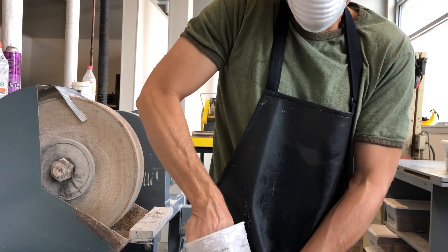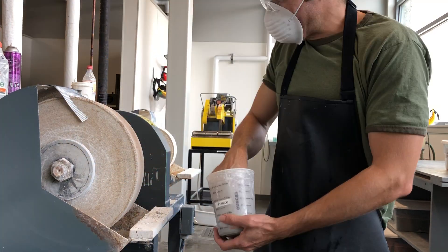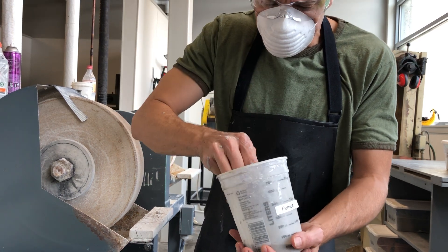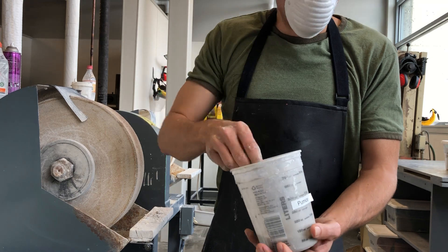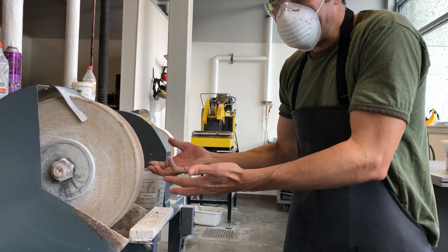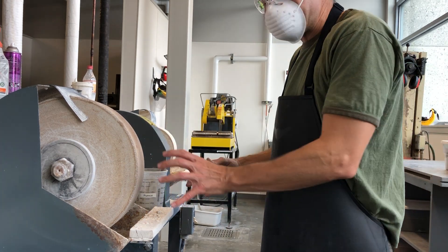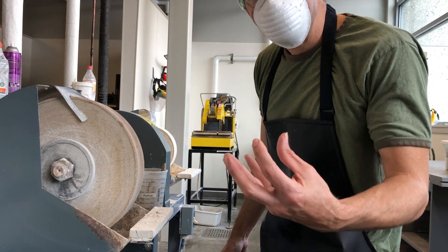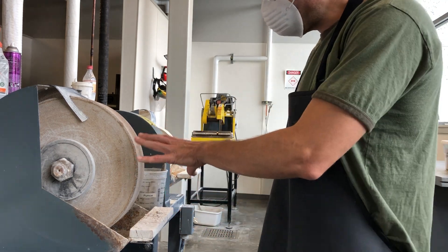You will be adding this material to the glass — this is what's going to polish the glass. Without this, you're just standing here pushing on this cork wheel doing almost nothing. I want to make sure that I've got this nice thick mud, thicker than heavy cream, kind of like a custard, that I can apply to the glass. I'm not going to be applying it to the wheel because it doesn't stay on the wheel. When I move over to the cerium on the felt wheel, that is absorbent and can become impregnated with cerium where I don't need to add very much to it. But for this cork wheel, it's not like that.